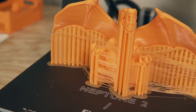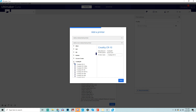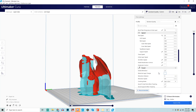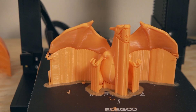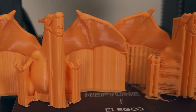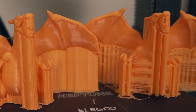I typically use the default Creality Ender 3 profile in native Cura, so I loaded that up and reprinted with nearly identical settings but using the Ender 3 retraction settings. The difference was huge — a night and day difference. The main issue was that the retraction settings on the Elegoo profile included on the micro SD card definitely need some dialing in.